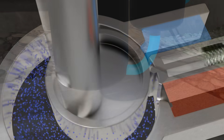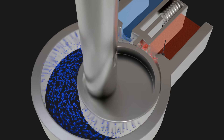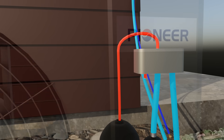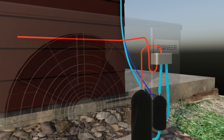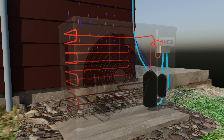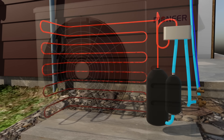The vapor then enters the compressor. Gas is pulled into a chamber and squeezed into a smaller volume by a rolling piston. This raises the pressure and temperature of the gas before it exits. This is the hottest point in the cycle, with a refrigerant temperature somewhere around 120 degrees Fahrenheit. Now that the vapor is so hot, it can give off heat to the outside air. As it travels through the exterior coil, it loses energy and begins to condense back into a liquid. Just like before, it maintains that same high temperature during its entire phase change, which helps improve efficiency of the system.